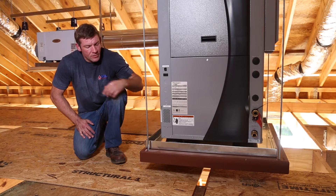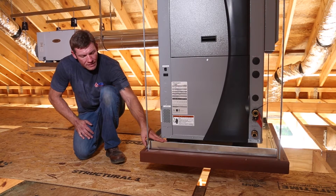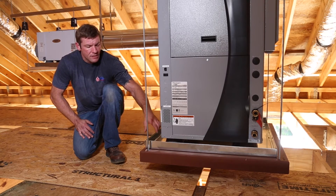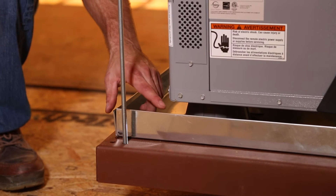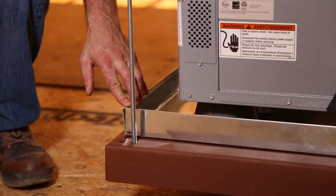One thing I want to quickly note is drain pan sizing. There needs to be distance around the equipment. You can see I got a little tight here — I did this because this unit is so large and it's just tight on the steel plate. But at least one side has a good gap to allow for my float switch. Every unit should have at least an inch or more of clearance around it.